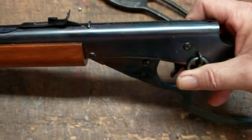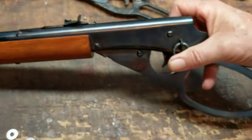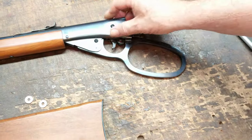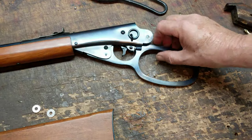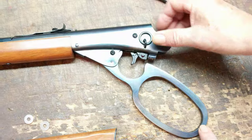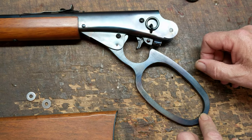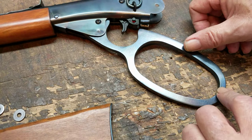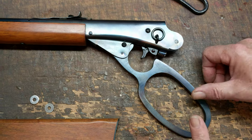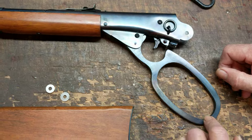It's not a complete RestoMod. It had some mods on the gun when it showed up, but the customer wanted the original paint removed and wanted steel fire blue — we've done that. The gun showed up with a Chief AJ large loop lever. What we did was strip the heavy-duty plastic coat that AJ puts on the product out of the factory, polished it up, removed as many scratches as we possibly could, and fire blued the lever so it would match the rest of the gun.